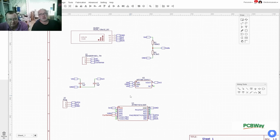For that you would need a diode, you would need a coil, and this way we're getting around with two caps and we're done. In fact, to be honest, using a DC to DC switch mode on such a low load of 10 milliamps may even have trouble regulating properly. So yes, this works, guys. We're sure this works. A very simple device, very low component count, just that and two capacitors. And this one could handle 33 volts maximum input. So it's fine.